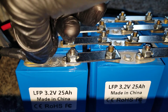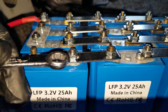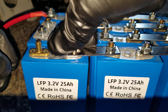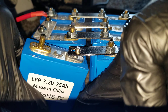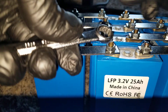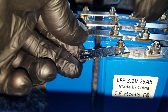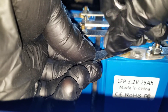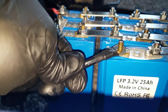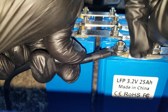I know a lot of you are scared because someone said I should put tape on that wrench or socket tool. Yeah, I know it's scary — you have to be very careful when it comes to batteries like this. They hold a lot of power and can cause a whole bunch of destruction. What I'm doing now is taking this bus bar out — I'm doing this at my own risk. Don't try this at home. You have to tape your tools — you don't want to get zapped or arc.